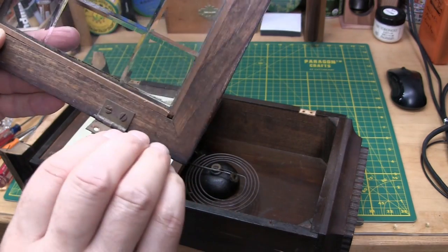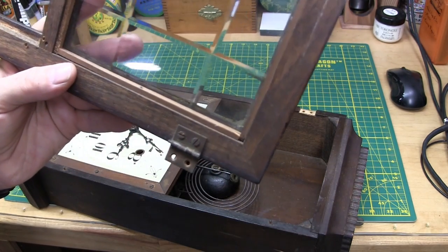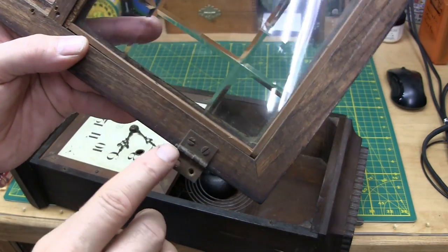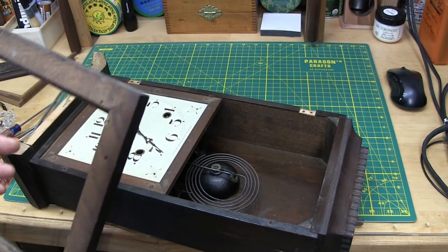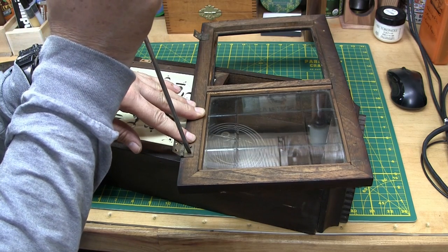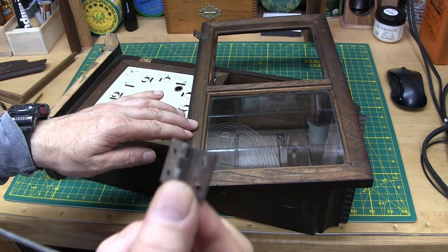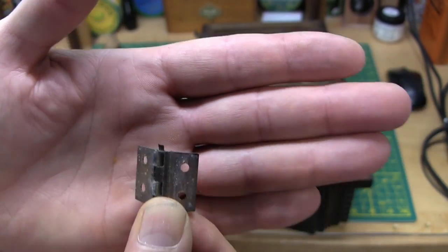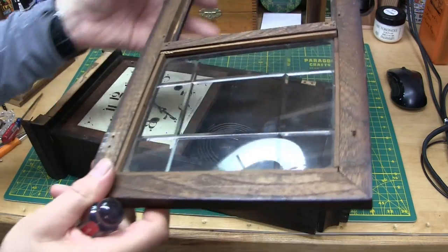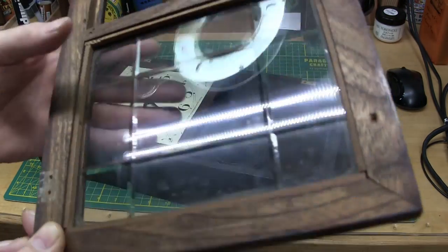We'll take off the hinge. The hinges are really, really tight and the pin has worked its way up a little bit, so I'll have to clean those up. I'm going to note the orientation — that's going to be the way I put them back on. I can see right away that one of these retaining wood clips is on top of the other one, so it's not even actually hitting the glass, and that is making it loose.